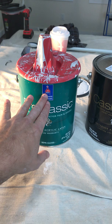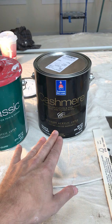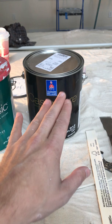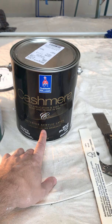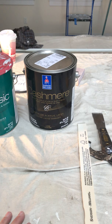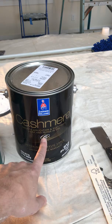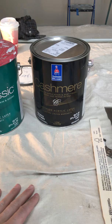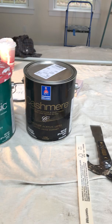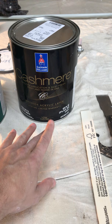Cashmere — great paint. I've already done a little bit of a review on that. It's thick. My last job I actually used it in a medium luster for my trim, and yes it did work and it did come out good, but it was just thick to work with, and the first coat didn't cover hardly anything. I was going on new wood — I primed it, and after the prime coat I put a coat on in medium luster and it just barely covered. The second coat covered and it looked good. But for walls, incredible. I've also heard you can't do touch-ups — listen, I've done multiple touch-ups with this on a wall where I didn't have to re-roll the whole wall. You just got to know what you're doing.